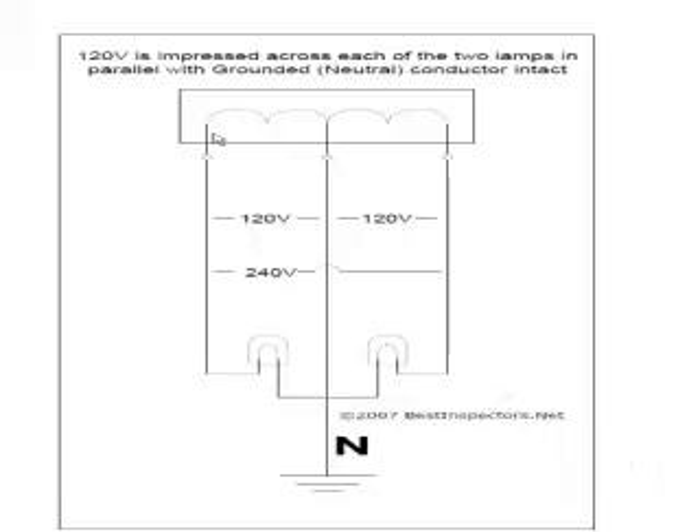These are just our measurements. It's a standard split-phase single-phase US service that you would have in a home. It's called a split phase because this is a single coil with a center tap. The actual transformer is 240 volts out, but by center tapping it we're splitting this secondary into two separate 120 volt phases. This is the typical household arrangement: two sides, 120 volts each, and if you take the ungrounded from each of those, you have 240 volts.